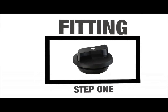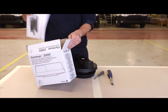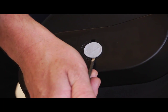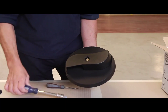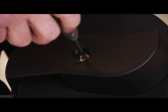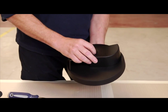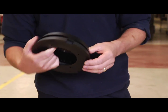Fitting step 1. Remove the vent from the box. You should have a rotor and shutter assembly, a set of fitting instructions, a grey plastic cap, and a small plastic bag containing 4 nuts and bolts. Start by prizing the grey plastic cap from the top of the rotor with a flat-headed screwdriver and remove the locking nut using a half-inch or 13mm socket spanner. Hold the rotor and unscrew the second nut using a screwdriver inserted in the slot at the top of the spindle, turning the screwdriver clockwise to release the nut. Keep the two nuts in a safe place for later. Disassemble the rotor from the rotor base, then unclip the shutter from the support ring and set these aside for later.